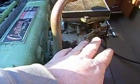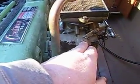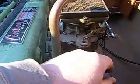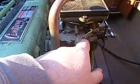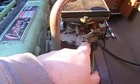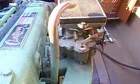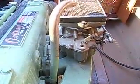Yesterday we did have some leakage of gasoline right around the accelerator pump - it has stopped by itself, we didn't do anything, so we're a little concerned about that. Even if we replace the accelerator pump and whatever kind of seal is under here - it's a Bendix carburetor, by the way, the first one we've seen - our specialist place can get the parts and they're getting mobilized just now. I would watch this every spring: start it up on a fake lake and make sure you have no leakage around this shaft. It's probably a leather seal that sealed up once it got wet with gasoline. Even after we correct it, if we find another leather seal, it's still going to be something we have to watch every season, just because of the age of the carburetor and boat.